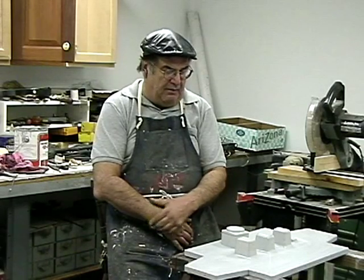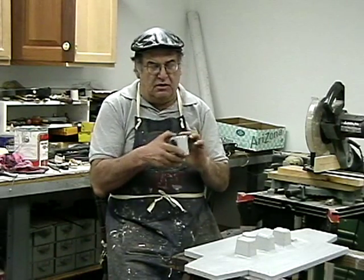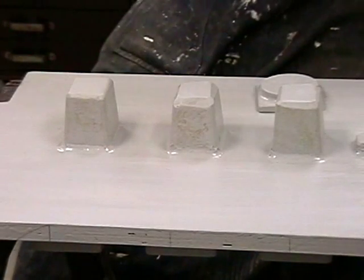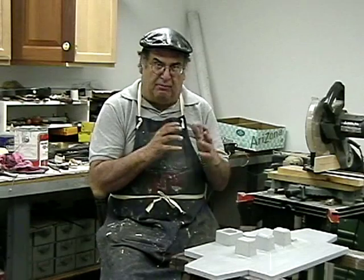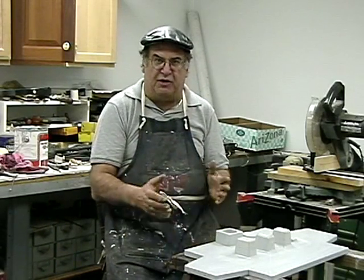And I've been making a journal box casting pattern, which we had one before for Mercer. It's 2.5 inches wide this way, and 2 3/4 in length. And then this is roughed out for the bearing. I use a ball bearing, I think it's a thrust bearing, a one-way thrust, and it has seals on both sides, and it's pressed in there. I've seen them anywhere from $22 on the internet, and the cheapest I found was $7 or $8, and I'll probably get those.